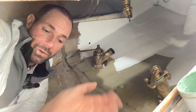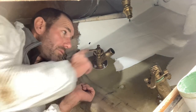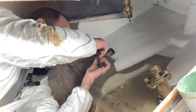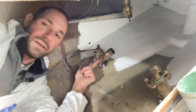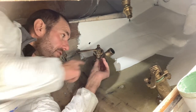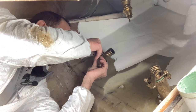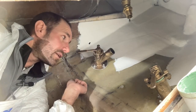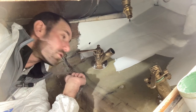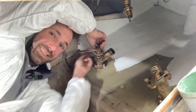What you need to do to get started is disassemble your seacock. These will have a locknut, and that locknut is normally located under the flange on the older style Blakes. On newer style Blakes, which have a grease nipple coming out the side, there sometimes isn't space for the nut underneath, so the nut can go on the top. It doesn't matter which way round that nut goes — the only thing that really matters is that it works as a locknut, so when we put it back together again I'll talk about that a bit further.